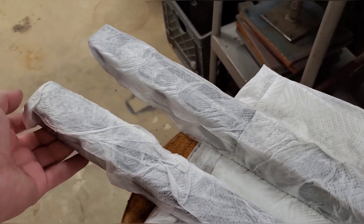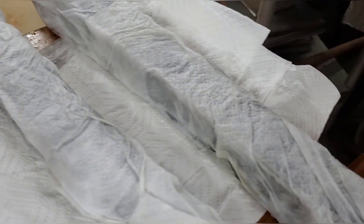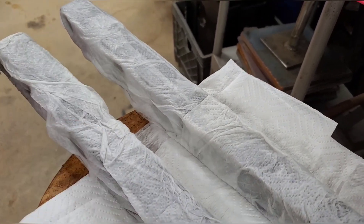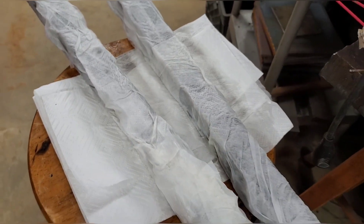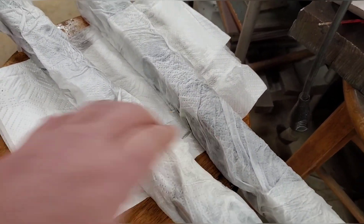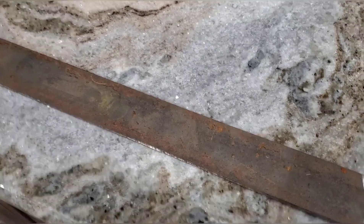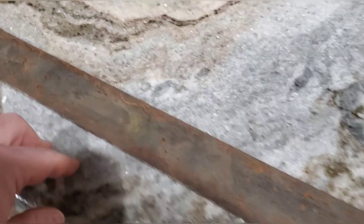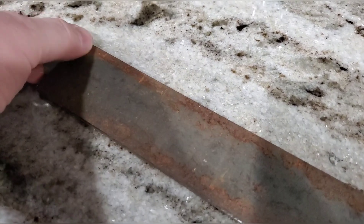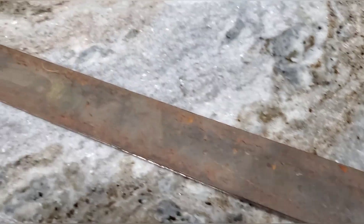I didn't record video of me actually wrapping this in white vinegar because it's kind of self-explanatory. I took some paper towels, made sure the vinegar was on the steel really well before wrapping it, then soaked the paper towels in white vinegar. I'll leave it for 24 hours and come back tomorrow. Here's a good example of what raw hot rolled steel looks like when you get it from the metal supplier — unlike the other square tubing I had, this has been untouched. It's even got some surface rust to it. We'll see what it looks like after soaking in white vinegar.